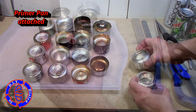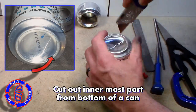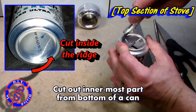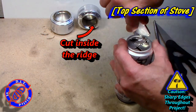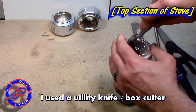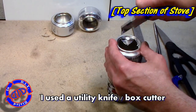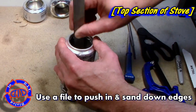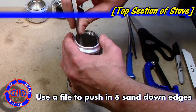Just like in previous builds, we need to start out with two empty and clean beverage cans. These aluminum cans are great, and we're gonna start by taking one of them and cutting out the bottom inside that innermost ridge. You can score it and pop it out, or you can take a box cutter and start carving around, then go back with some kind of a file and just get rid of the extra burrs and material.